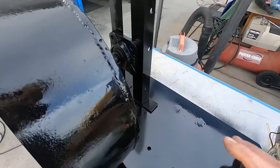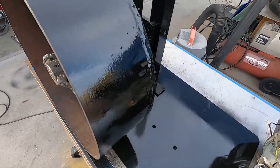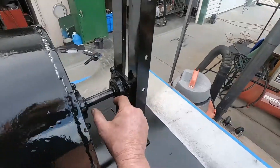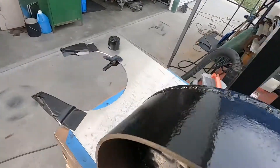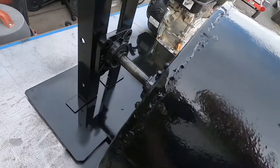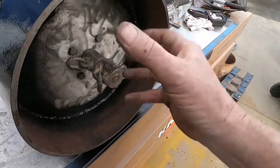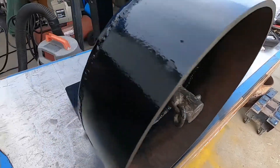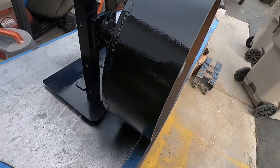I'm going to mount it up here and weld all this stuff together — it's just all sitting here literally. I'm going to weld on the frame, weld these guys into place, mount the pulley in here — the five-inch one. It looks precarious but it's not really, because I can just take off the front face here and pull this dude out once the pulley's loose. If I touch it, everything will fall over right at this second.